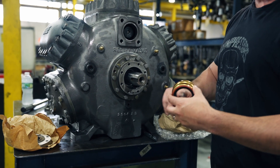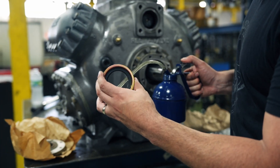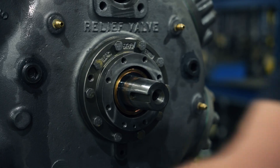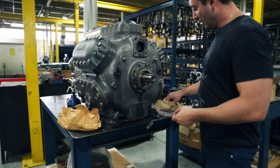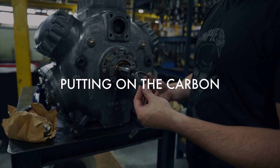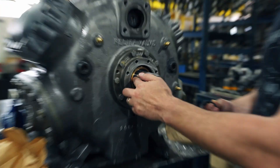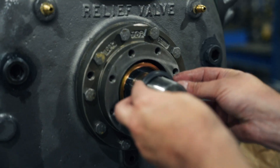Get some oil and put a little coat of oil in here, and a little coat of oil on the inside where the rubber seal is. Now carefully put this on. Next, put a light coat of oil on your gasket, then place the carbon — always make sure you don't scratch the face. Look at the little divots on each side; they're going to line up on the seal so it locks into place. Put this on very carefully.